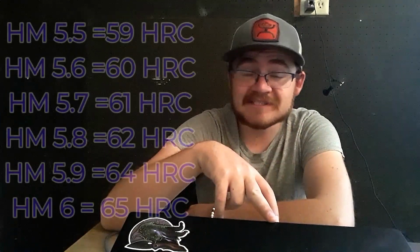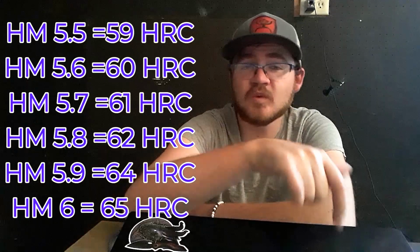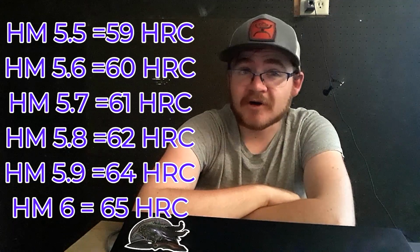I think, however, after doing little experimentations and using this conversion calculator, I should be fine using most steels that have a hardness between 59 and 61. Steels within that 59 to 61, heck, even 59 to 63, 64, those should be completely fine. Those should fall within that 5.5, probably 5.5 to maybe 5.8 Mohs hardness range. Anything higher, if we start getting into the 65 to 68 stuff, probably is going to be a little bit too hard, but there's very few knives that are that hard, very, very few.